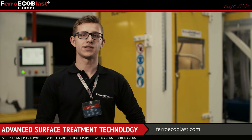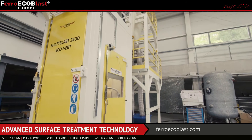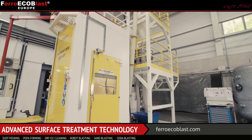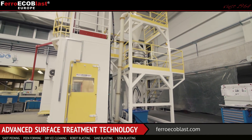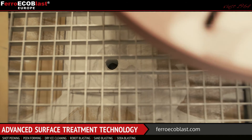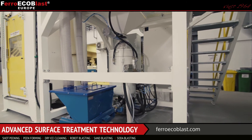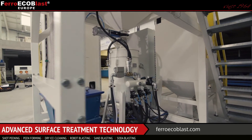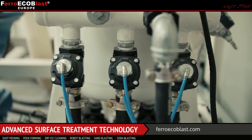This process of blasting requires suitable filtration of the blasting media. Behind the cabin we can find a large tower that has all the necessary components for this job. When the blasting cycle is on, the entire blasting media is collected in hoppers under the cabin and it's sucked into the filter system through polyurethane tubes, which by the way last a lot longer than iron pipes.